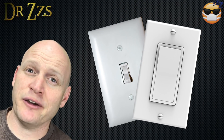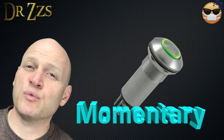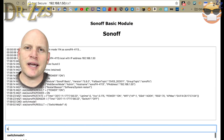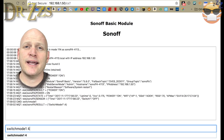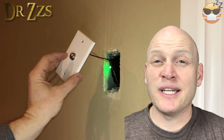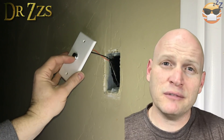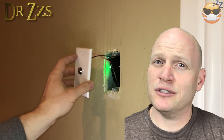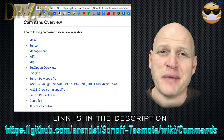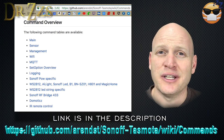Now if you're using a rocker switch, like your standard wall switch, that's all you have to do — you're ready to go. But if you want to use a push button, there's one more thing you need to do. Go back to the main menu, click Console, and in the text box type 'SwitchMode 1 4' and hit Enter. That command changes the function of GPIO 14 so that when you connect a push button switch, if it's on and you push the button it'll go off and stay off, and if it's off and you push the button it'll go on and stay on. You don't have to restart the Sonoff for the SwitchMode command to take effect — it starts working as soon as you hit Enter. If you're interested in what the Tasmota firmware can do, there's a whole list of commands you can type in at the console.